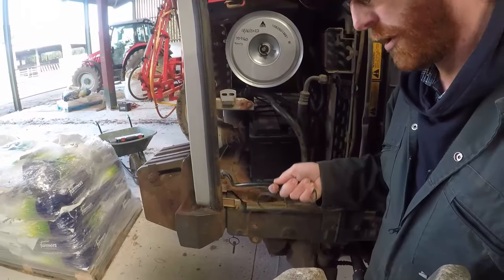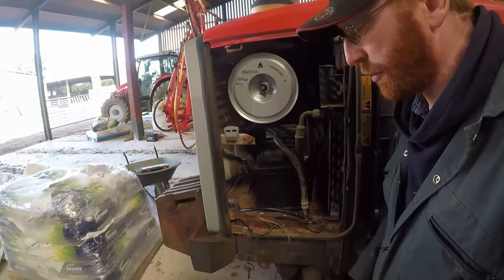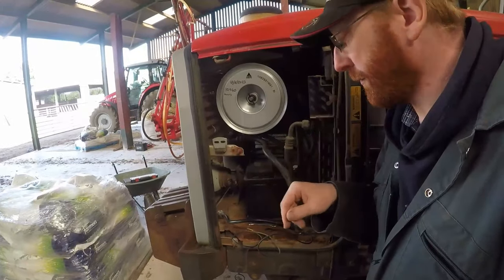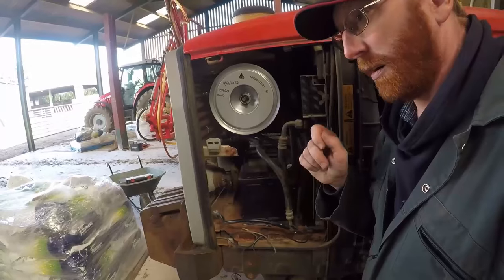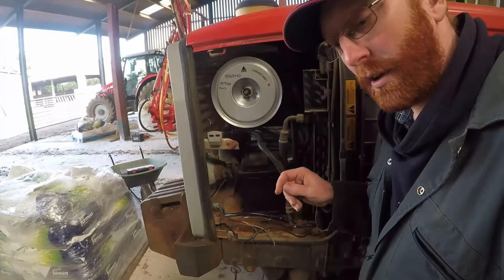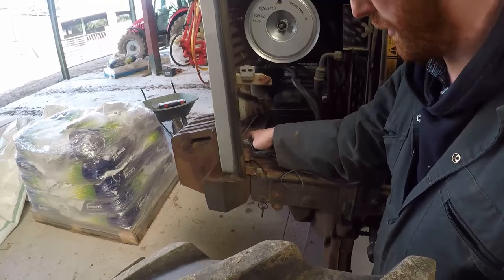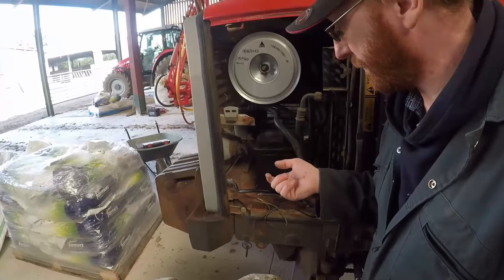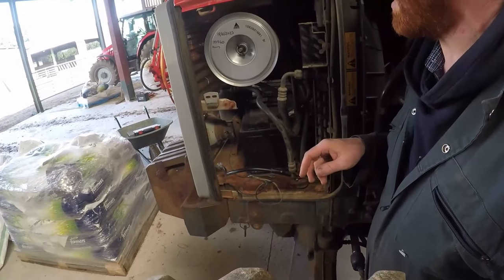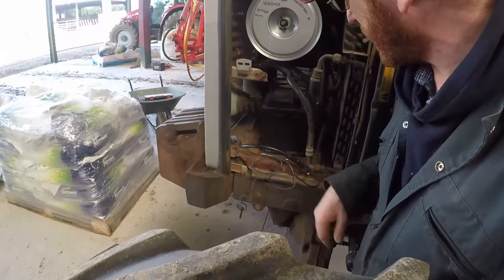This tractor, like a lot of others, does suffer from some electrical issues, which is why you've not seen it doing any work yet — I haven't got to the bottom of it. A lot of those electrical problems are down to either a bad earth or a poor connection. I have found some bad connections underneath the cab on the autotronic box and changed those — they were corroded — but we still haven't got to the bottom of the problem. Partly fitting this switch is for safety reasons; the second part is I want to get away from earthing at the front here to minimize the chance that this corrosion is causing problems. We're going to remove the earth strap from here, put it somewhere different, and in time this whole front end needs to be cleaned out — this plate will have to be remade, but that's a job for another day.